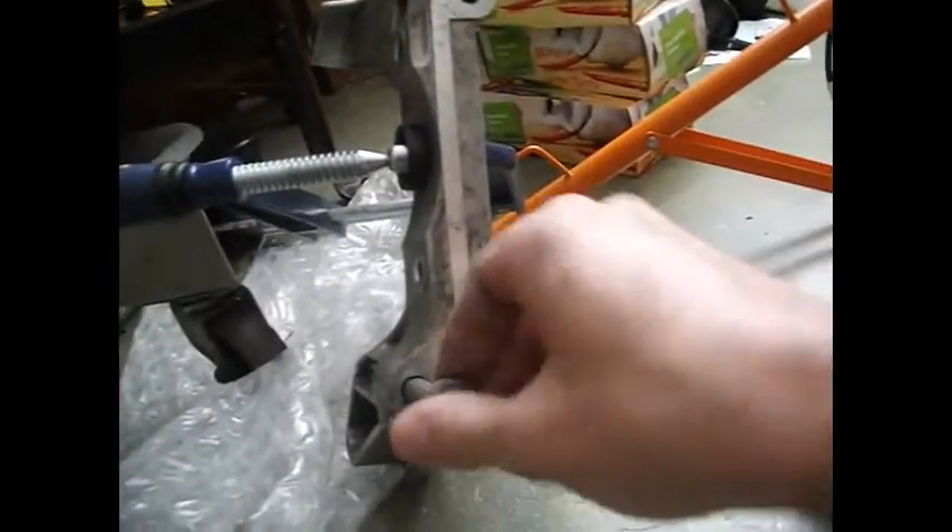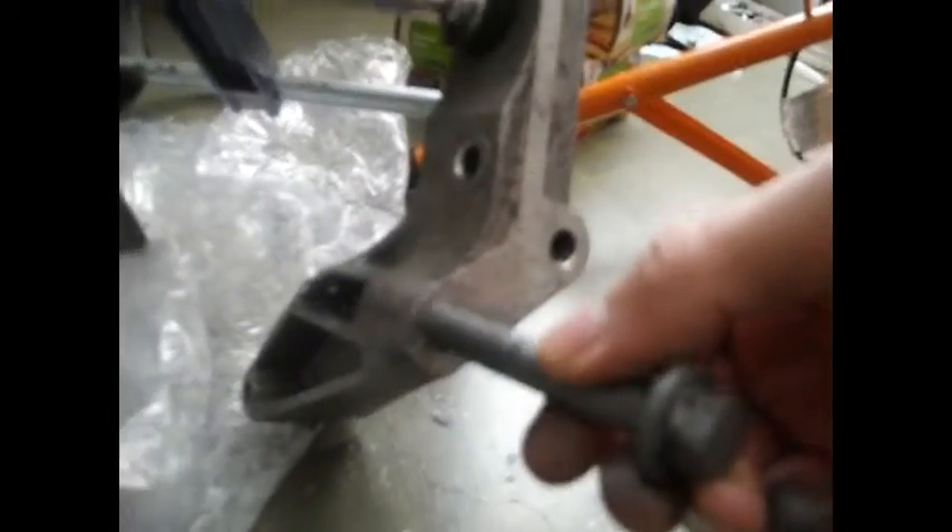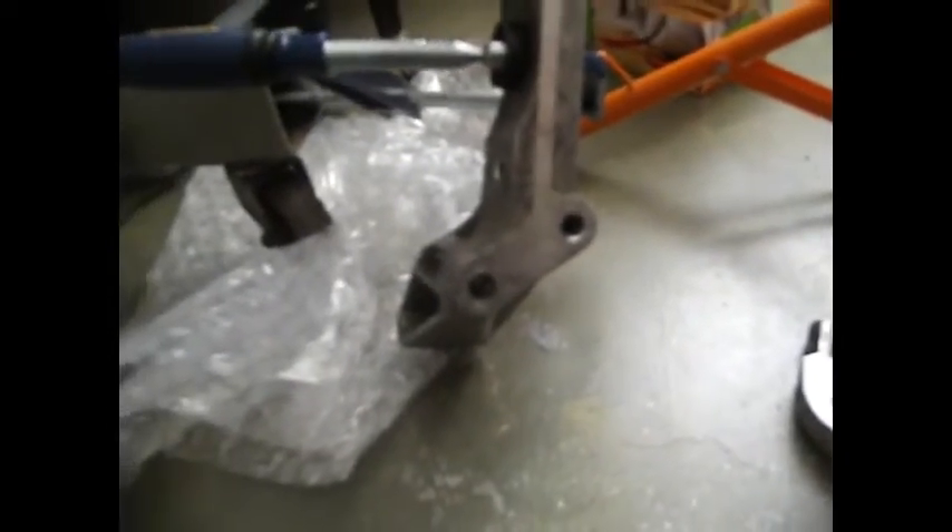What I've done over here is you can see I have stripped the thread completely from this hole, see. I'm going to show you that there is no thread — it's all gone. 100%. Because this thing has passed through, it's like a tunnel boring machine, if you like. And if you put that bolt in, see, it goes all the way down. So what we're going to do now is we're going to actually rebuild the threads — we're going to manually rebuild it.